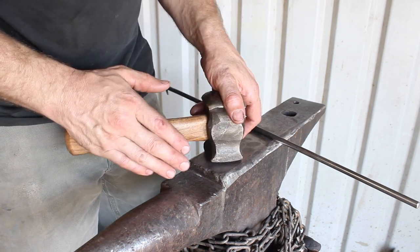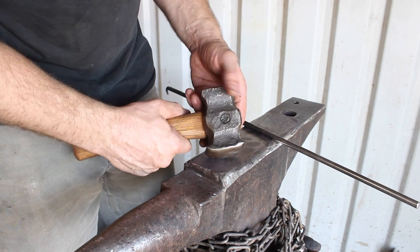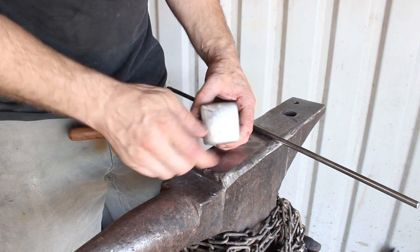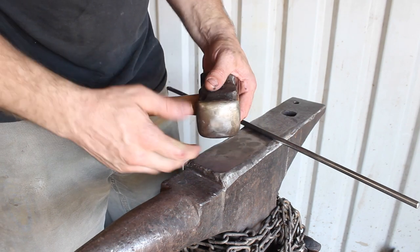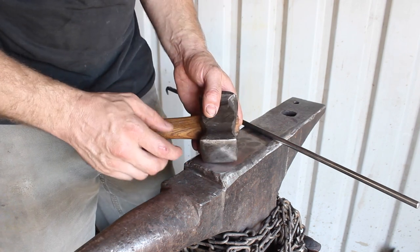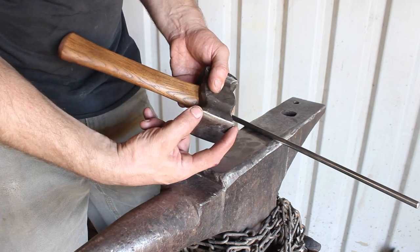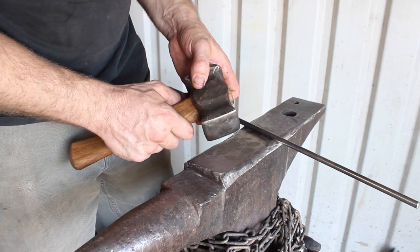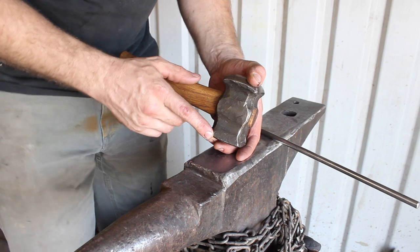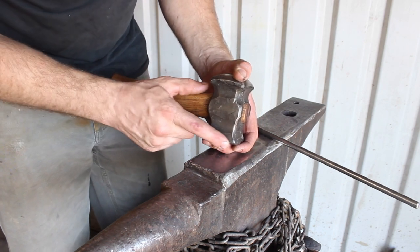There are a lot of different styles of rounding hammers out there, but I want to talk specifically about the Fire Creek Forge rounding hammer. You'll notice it has a square face — mostly square in shape on this side as well. The reason for that, as with some other hammer designs, is that it gives you a much longer die area on all four sides of the hammer. This is extremely beneficial in a lot of different applications, especially bladesmithing, where you can use this die to really get into spots and forge with it.